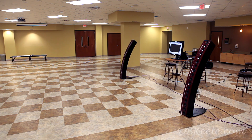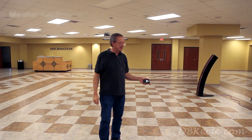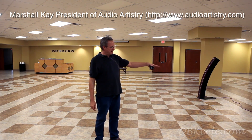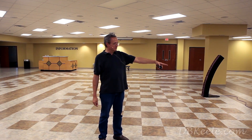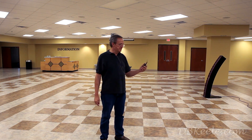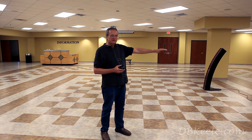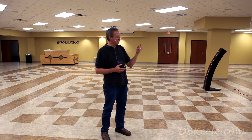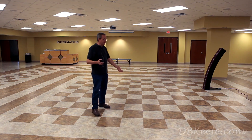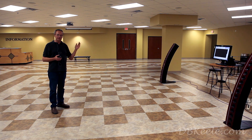The comment I was making to Don was that when I first saw this design, I was worried that since the center of acoustic radiation originates from somewhere behind the speaker essentially on the floor, the image would sound like it was coming from the floor — which I don't like. I personally like an image that's tall so it feels like I'm listening to real people and real instrumentation. In fact, on this speaker that's exactly what happens: as Don describes it, the height it takes on is up higher on the speaker, and because the center of radiation is way behind the speaker, the lines project out such that when you sit in a chair anywhere along here, the height of the musicians feels natural — at the right height. For those of you who think that may be a problem, it is not.